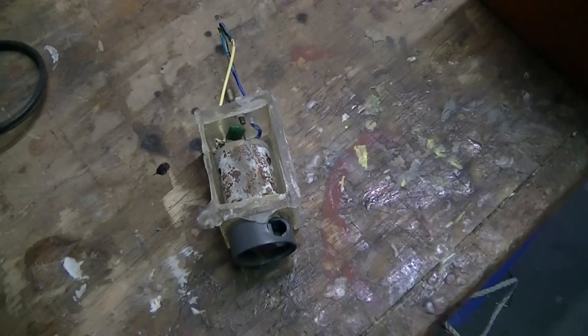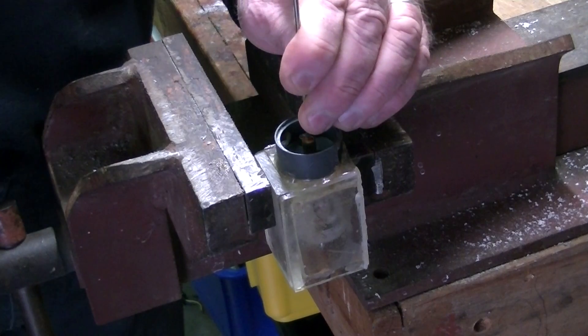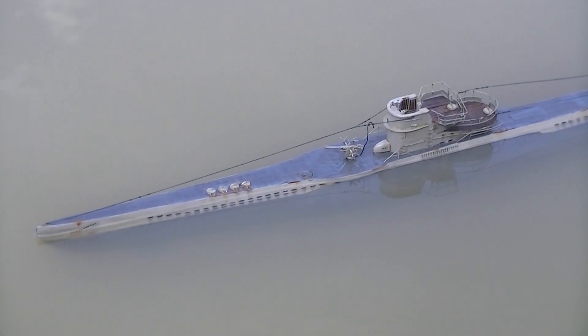Right at the beginning of this process, I had a two-way impeller pump working with my ballast tank — a Sub-Tech pump, years and years old — and it died. I replaced it with a gear pump which was very slow, and the best kind of pump for this model is an impeller pump. I couldn't find one, so I built one — got on the lathe and made one. It empties and fills the tank in 12 seconds, really fast.